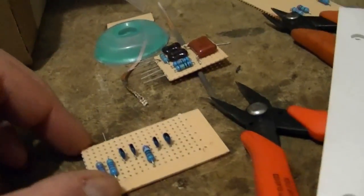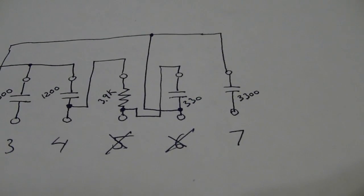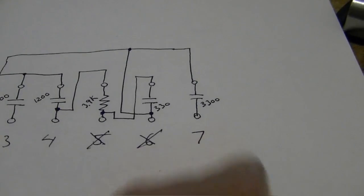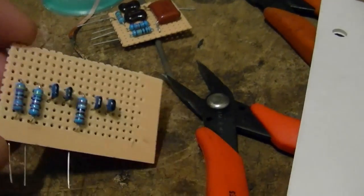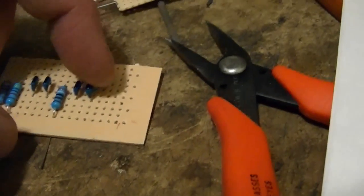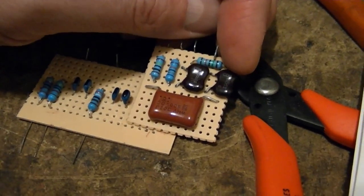Now for this guy, notice I have much smaller capacitors on here. These are ceramic. I want ceramic for the in-between values, like 330, 1000, 1200, and yeah, even one of the larger ones, 3300. Figure if I'm going to use 3 ceramics on this, why not just go with all 4? And see how small they are. These are rated for 630 volts. So this is about the same as this guy. Plastic film, ceramic, almost the same capacitance and same voltage rating.